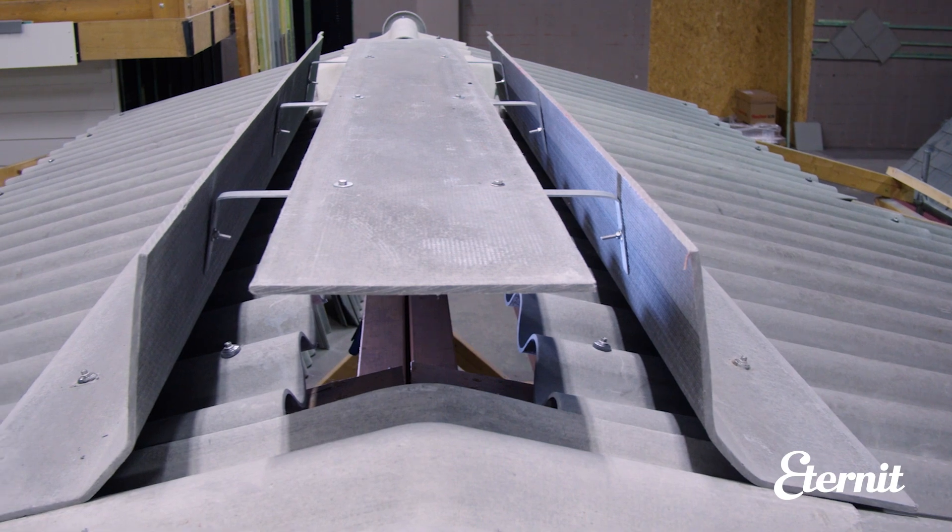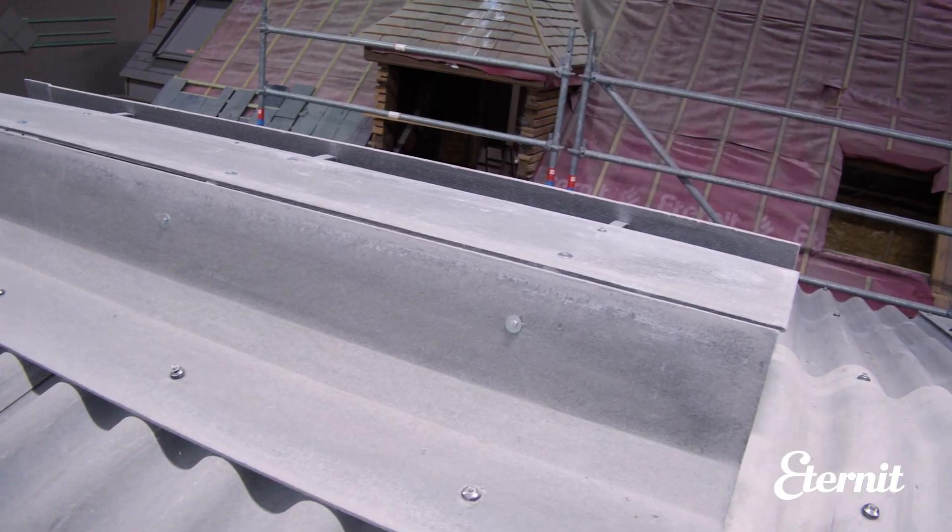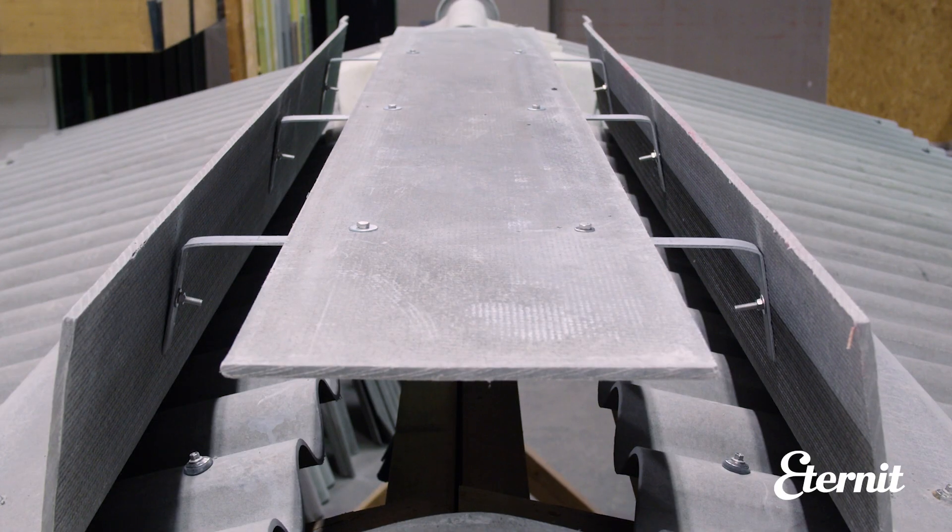Ventilation should be properly designed to suit the size and shape of a building, together with the quantity and size of the livestock housed within. This will determine the size of the gap to be left between the two sheets at the apex. However, the gap between the top purlins on either side of the ridge cannot be more than 300mm for the ridge to be classed as non-fragile.